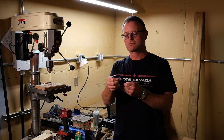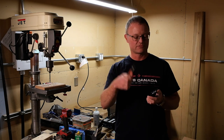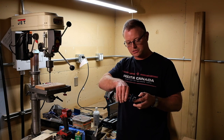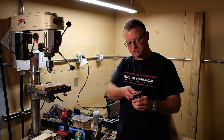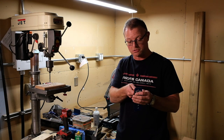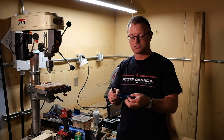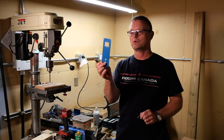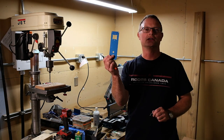This piece in the middle isn't quite ready to fall out, but with a pair of side cutters you can cut the remaining bits that weren't cut by the drill bit and persuade it to pop out. This is thankfully soft aluminum — don't do this with steel, it'll ruin your pliers. Aluminum is nice and soft so the pliers won't be damaged. Now we have a rough rectangular hole, but it'll get cleaned up in a moment with the file.